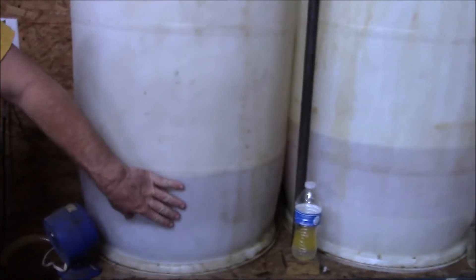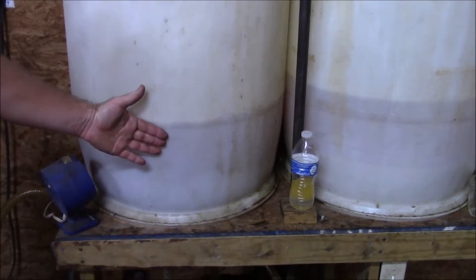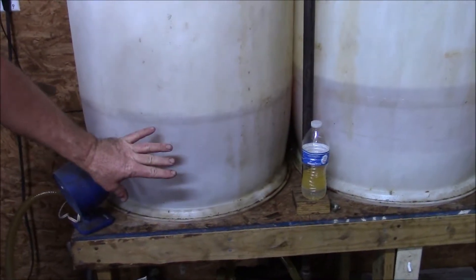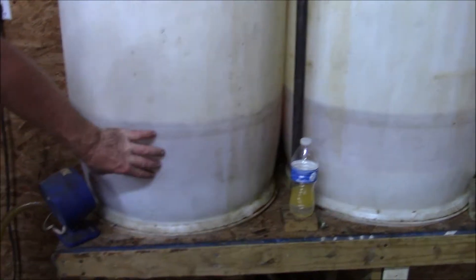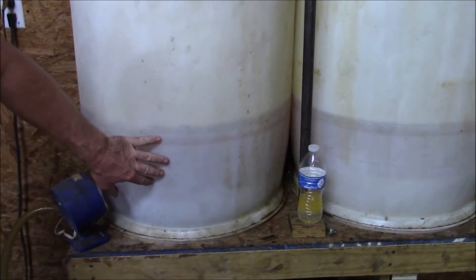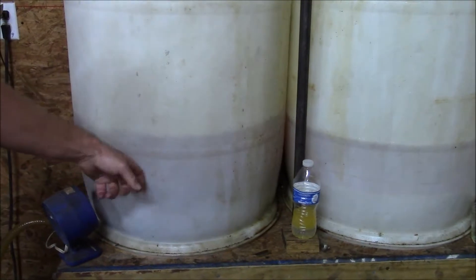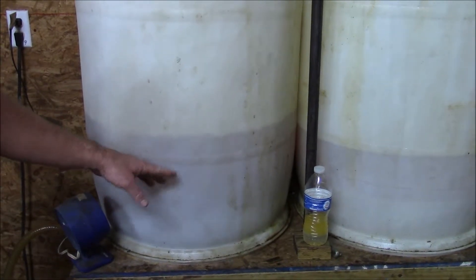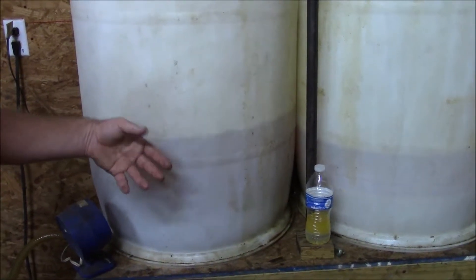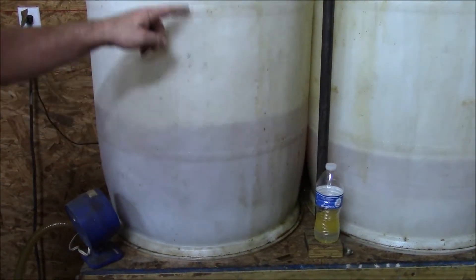As you can see, it's fairly dark right now, and this product will darken further as it dries. Hopefully the next time we look at this, we can see the difference in shade. You really want to look at the color of the biodiesel to determine if it's drying. If there was a lot of soap remaining, the water would stay with the biodiesel and it would remain a lighter color and wouldn't darken. Along with the darkening, you can see it clear up too.